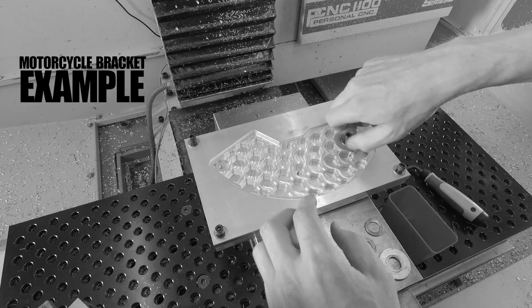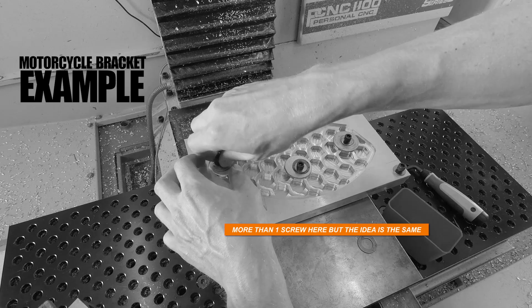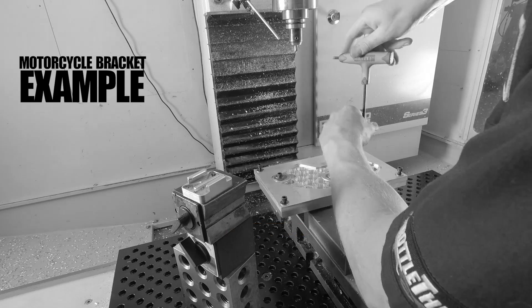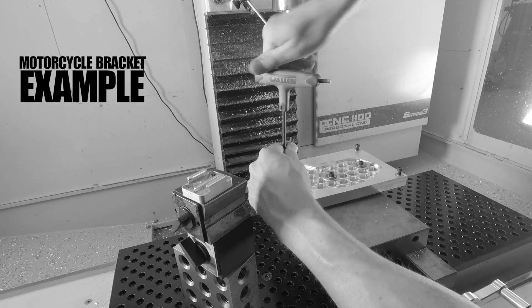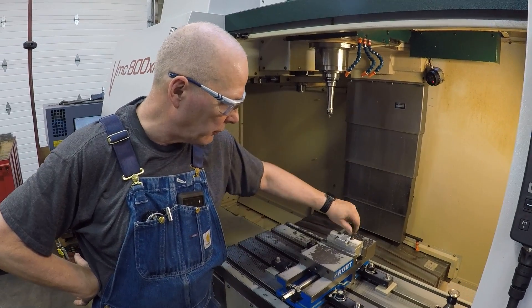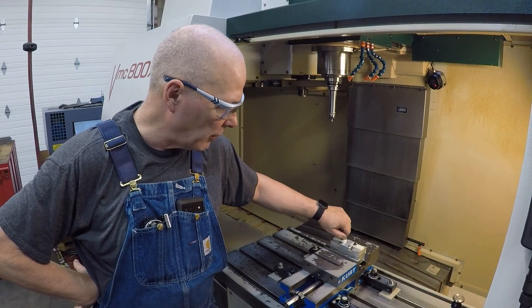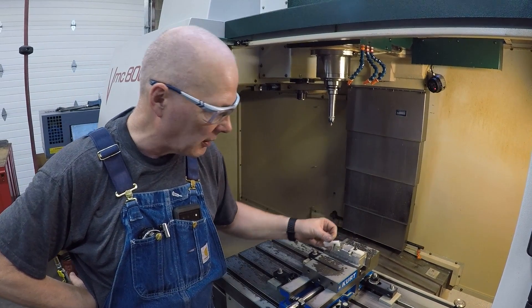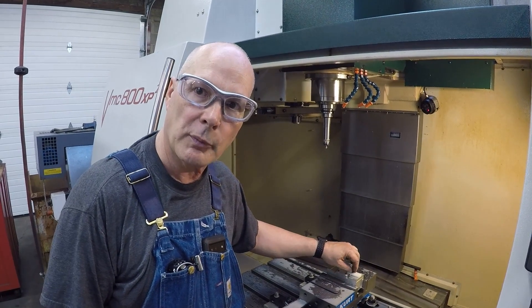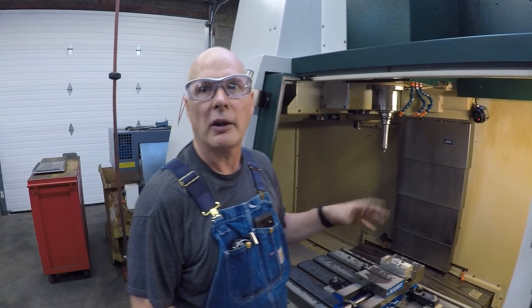One awesome key thing Paul mentioned is that sometimes having two really light-duty clamping elements is all you need. If you have a part of a known dimension, you machine a mold or insert that goes around the part — you can clamp the heck out of that jig — and then you might just need one tiny 10-32 screw to keep it down. That fixture around it holds it much like you'd block in a small thin part on the surface grinder. You need to take the clamps loose — these plastic ones didn't need a lot of clamping pressure to hold it for drilling.